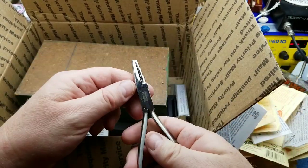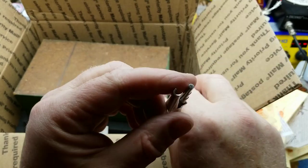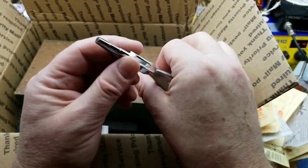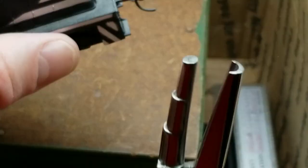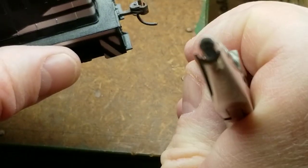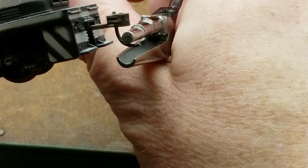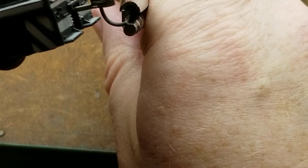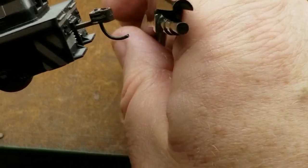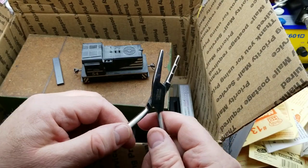A pair of — these are also a KD tool for model railroading: a trip pin adjuster. These pliers are for putting the proper bend into that little trip pin. They've got a pin on one side and a recess on the other. You put the trip pin in between there and squeeze to bend it in a nice gentle curve, or flip it over to put the reverse bend in — or flatten it out. Different radii available; it's a handy little tool for a very specific purpose.